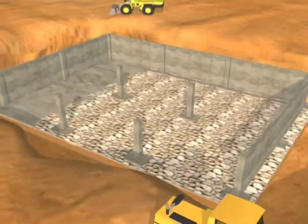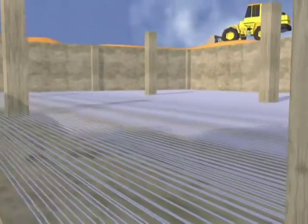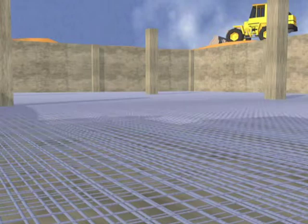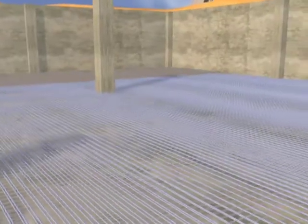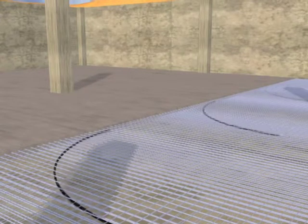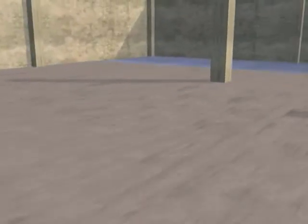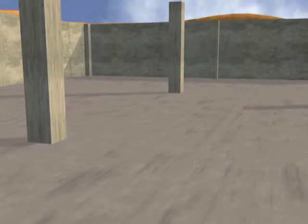A basement raft slab, which is cast in separate pours, can leak through the central vertical joint. To prevent this, after casting the first pour, just lay the water bar strip on the rebars against the vertical surface of the first pour. After laying Dr. Fix-It water bar, you may cast the next pour of the slab. You now have a leak-proof joint.